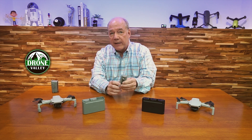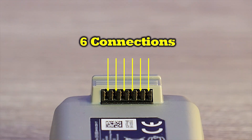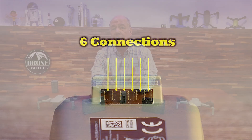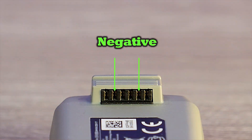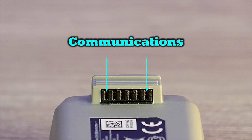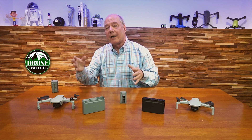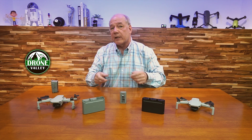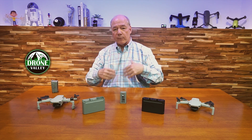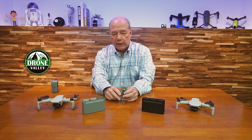Here's where the problem is. The Mavic Air 2 battery has its power button right on the battery itself. But where's the power button on the Mini 2 battery? There isn't one — you can only turn it on by hitting the power button on the drone. If you look closely at the battery connections, the battery actually has six connections: three pairs of two — two are ground, two are positive voltage, and two are communication lines between the battery and the drone. That communication is critical for flight decisions and battery level information.